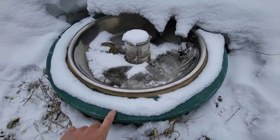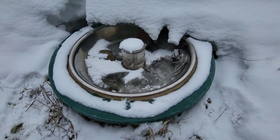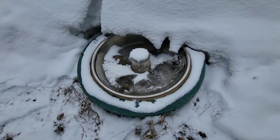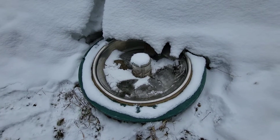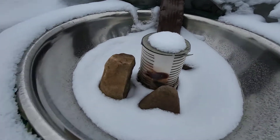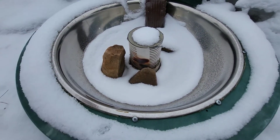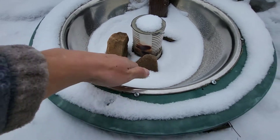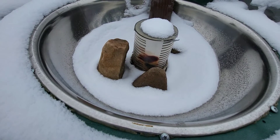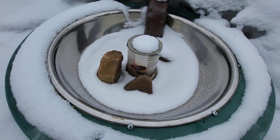The lid for the cistern gets cut out and the salad bowl just drops right in. You usually put some rocks or something in the salad bowl that filters out the worst of the sediment. You can get a better look on this one — that's actually a burn mark on the PVC there. With the sun hitting the salad bowl on the north side, the reflection starts to burn the PVC pipe. Filling it with more rocks will also help prevent that from happening.